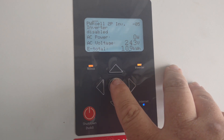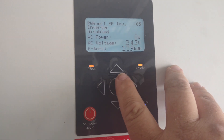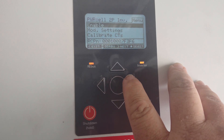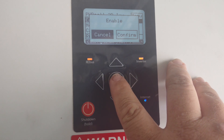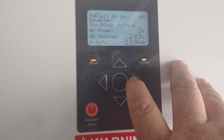Nothing's working right now because we have to reactivate everything. This is your inverter screen — sometimes this will be the first one, most of the time, sometimes it is not. But we're going to go ahead and try to enable that one first. Hit the enable button — the center button again — then toggle over to confirm and hit confirm.